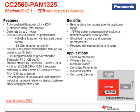TI's device has the best-in-class power consumption by using a technique called low power scan. Through this we get a consumption of 145 microamps. What this means is that in traditional Bluetooth devices, they're usually in some sort of scan mode where they're looking for other Bluetooth devices to connect to.